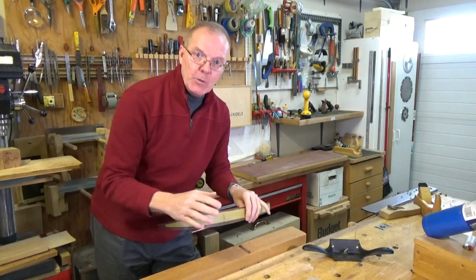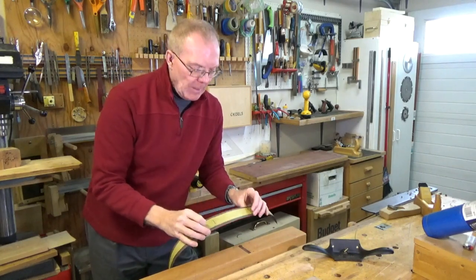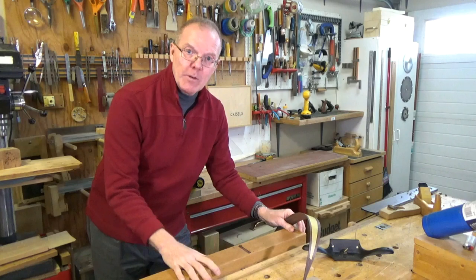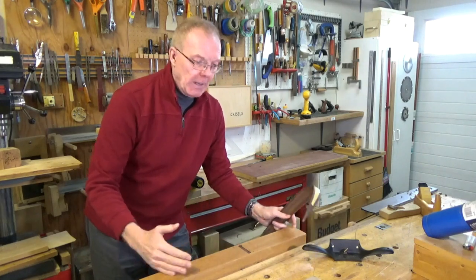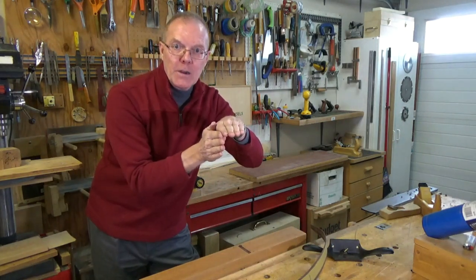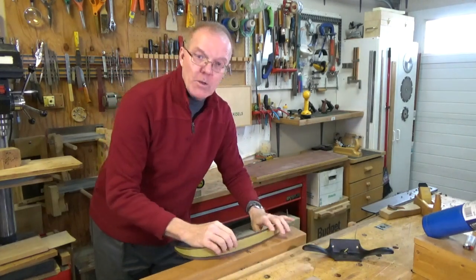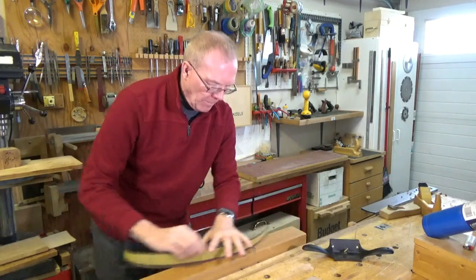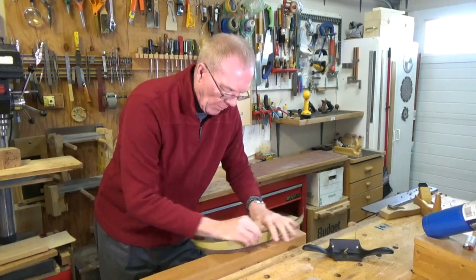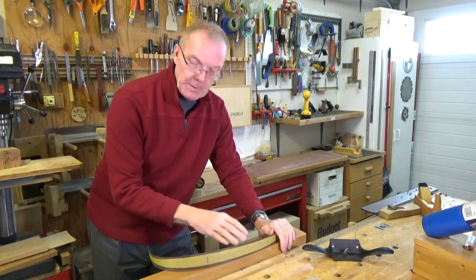To get between the chisel and standing up and hand planing, there's another stage I like to use: I have a large wooden jointer plane mounted on my vise. It's called an apron — the top of the workbench is like that and there's a piece of wood mounted there. You simply block the plane against that facing upwards so that you can do this. The plane is very sharp and set very generously so there's quite a bit of room for the chips to fall through.